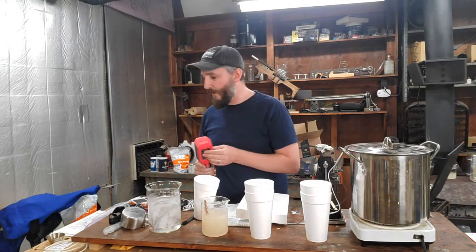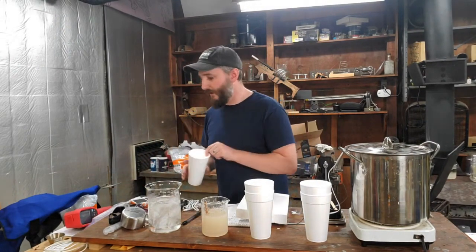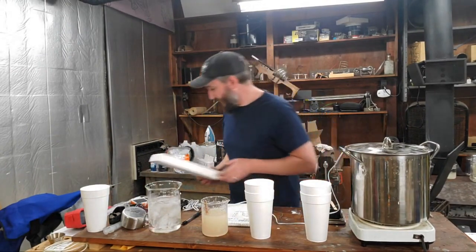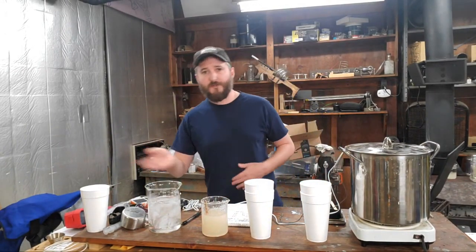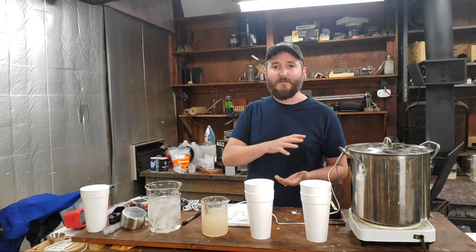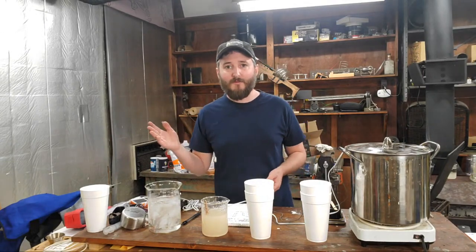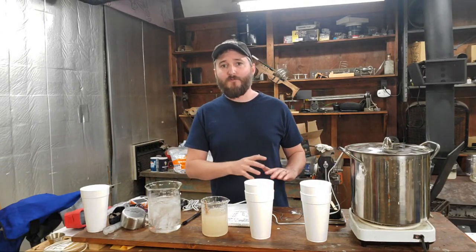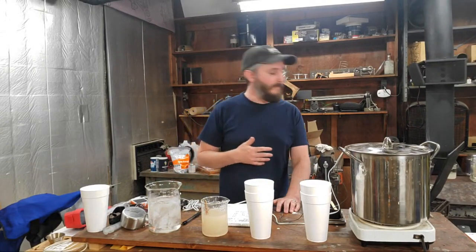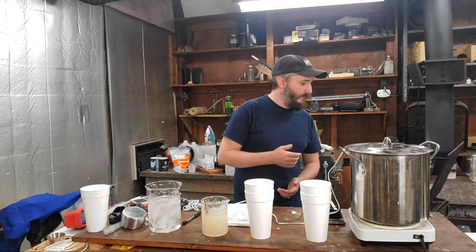I want to say probably you could do very thin, like molecularly thin layers of various metals. Sputtering is what you would call that, where you take an electric charge in a high vacuum and you electrically deposit a very fine metal film onto a surface, and you can get all kinds of properties out of that. You could make one of those films that passes most IR light, but then also reflects a lot of visible light.